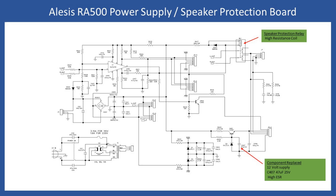This amplifier really hadn't had a lot of usage before this relay coil failed. On amplifiers that have been used extensively, you'll find that the power components discolor and often give off an odor when heated up. For this amplifier there was no indication of that at all — so it's a bit of a shame really, as the owner probably saw it fail and maybe had it in storage ever since. So there is no reason to replace those resistors.